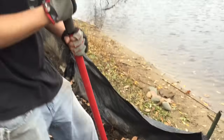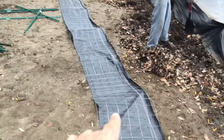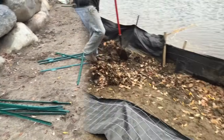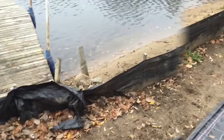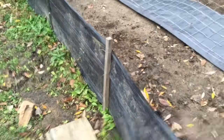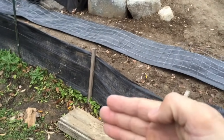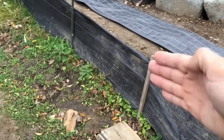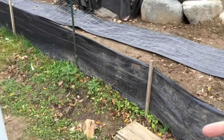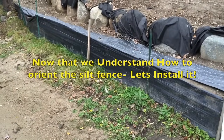The other important thing is which way you orient the silt fence. A standard silt fence will have wood stakes. A reinforced silt fence looks like this — it actually has wire mesh and is more of a permanent structure, and we use posts to frame it in. The posts are on the downward side, so as runoff comes down the hill it'll hit the fence. If you get a blow-off, the stake remains in place and the fabric will tear in between. If you had flipped this around with the fabric oriented on the uphill side of the stake, the mud could go all the way down and through. So it's important that you orient the silt fence the right way.